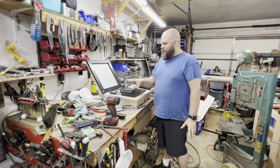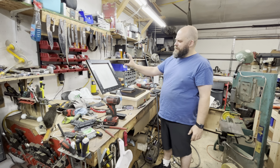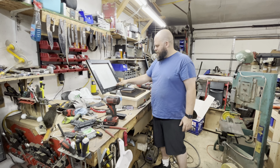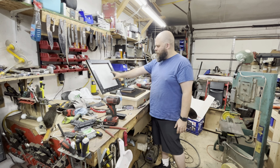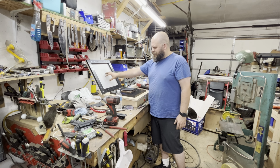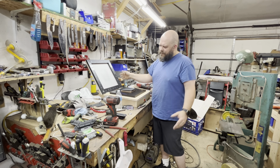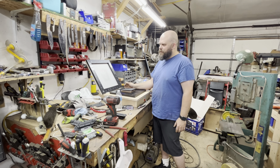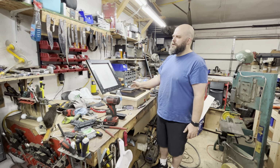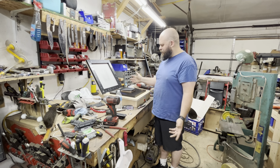But that is just another method of doing the same process of vacuum forming that doesn't need this additional lid or frame or this silicone membrane, which is a wear item. Eventually this will probably get a hole in it, it'll wear out, I'll have to replace it. Not that big a deal, it's the cost of doing business. But I think in the long run it's still a little bit cheaper overall than having that extra material that you're going to cut off.